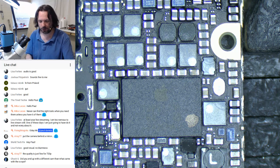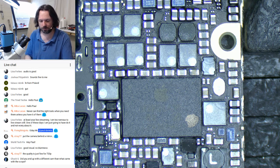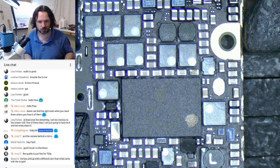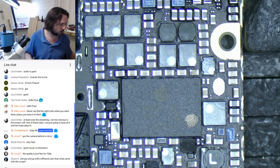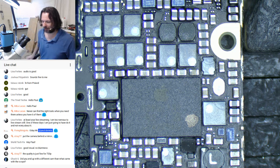The location of the prism vertically is different to what is set up in the microscope head. So I was only getting like 25% of the actual image, and the other 75% of the camera was just looking at the sidewalls of the inside of the microscope. So it was no good. It was a bunch of running around and stuffery and whatnot.